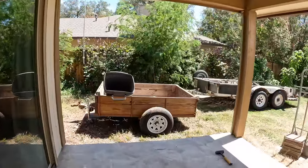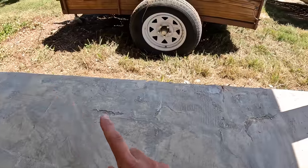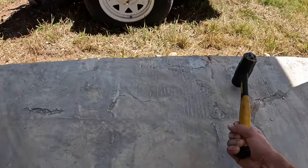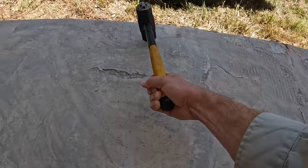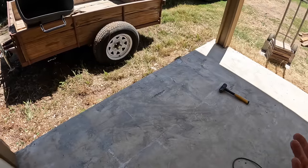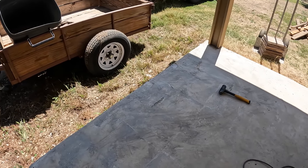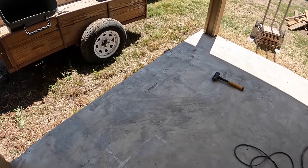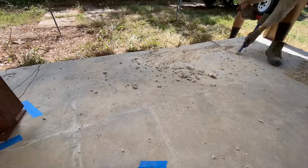I found that I have some faulty concrete on the edge of my slab. Looks pretty ominous - there are cracks along there, an exposed rebar here, and another tip right there. Obviously that's a bunch of loose cement - the edge here is damaged. That exposed rebar certainly didn't help. Moisture gets in, rusts the rebar, and the blistering of the rebar tends to swell and expand the cement to crack it. Cement is very good at resisting compression, not so good at tension, so when you push from the inside out it doesn't do well. This needs some repair. Step one of almost all repairs is figuring out what you're up against, and yeah, this was bad enough - it led to a whole spin-off video.